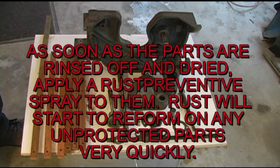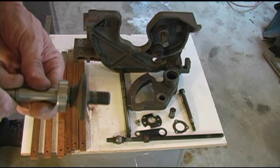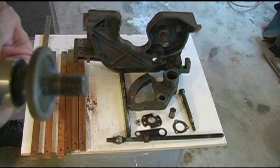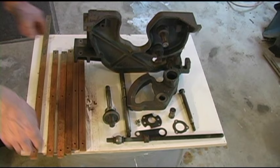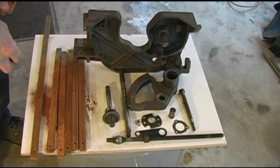Well, there's the results of our efforts and I'm going to say I'm extremely impressed. All I did with these parts over here, with the exception of the arbor, is I really wanted to give you a view of how well that shaft cleaned up. The only thing I've done to this is take a little $2 wire brush and clean it out, but there's still a nick or something in the first couple threads and we're going to show you how to fix that. I know the arbor is good - I've already got new bearings for it. The rust went from these parts to those sacrificial rods. You have any idea how much work we saved using electrolysis to clean this thing up?